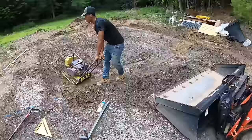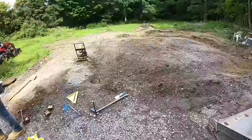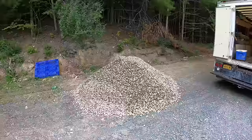Cut out, tamped in, and then got a little more cut in there, and then we'll start blowing stone in the center, get that to where it's got to be, and form time. All right, everything's tamped, boxed out. We're gonna put our boards on the outside of these pins, 20 by 20. We'll do three sides and then grade the center so I could get in and then put the last board on. There's our stone. We're ready for stone.